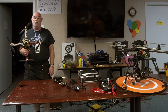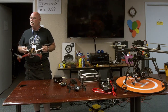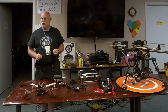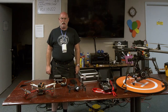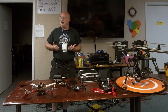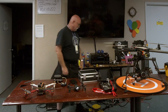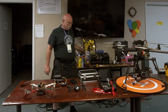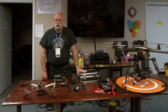We borrowed these from the airplane guys because this is all new territory. Turns out we reinvented the wheel. One of our guys was doing the flight loop, and a guy from JPL said 'I think I've seen this somewhere before.' He went to the archives, came back, and posted a snippet of code. There was this giant number in the middle — that's the main rocket motor for the lunar lander. We took all that thrust away from the main rocket motor, put it to zero, farmed all thrust out to the RCS thrusters, and it actually flies on that control board. It is running the lunar lander stabilization code — the same thing Neil Armstrong used to land on the moon.